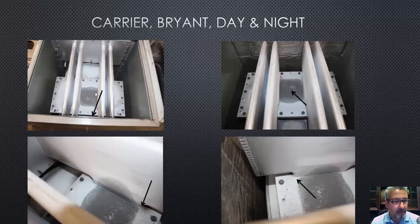See the heat stress there? That's always a concern. One thing that you want to check on these — it's got a round drum. This is where I'm pointing with my cursor. That's a rounded drum. It's an aluminized coated heat exchanger, and that is a round drum. The back of that drum, we have seen some failures. So you really want to watch that. Another place you want to check is right along here, and right here on these corners.